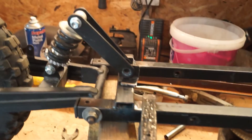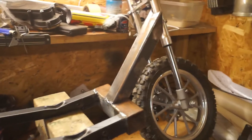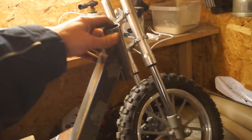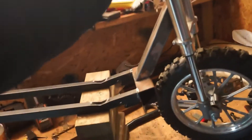Before my battery dies, I've managed to weld the suspension on, but I'm not happy with that position so I might need to move it. Started on the front end - that's going to be the handlebar stem, where the bearing goes. I was going to weld it on there for the bearings to go in for the front forks to sit in. That's the front end tacked together with a steering collar on, including the bearings now put in place. It's not the prettiest of things but it will be when it's painted. The steering is sorted but in position.